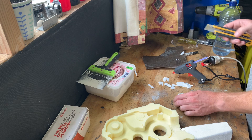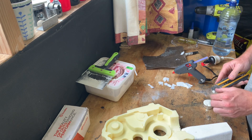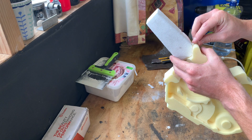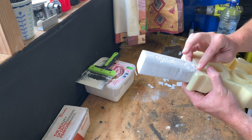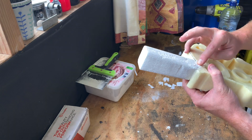With my limited budget knowing absolutely no bounds, and there being small gaps between the sprue and the pattern, I had to figure out a way to seal these up prior to plastering. The solution was to grab a small scented candle from inside the house and break it up with a craft knife — with the small pieces I could smoosh them into all of the gaps between the pattern and the sprue.